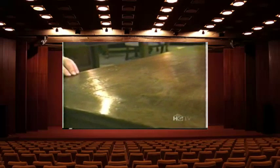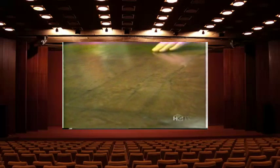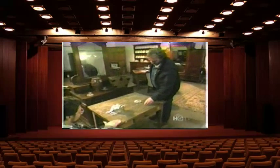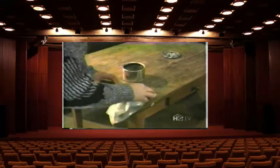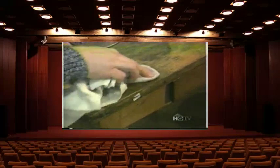The secret to the finish is not to disturb the natural wear. We never put the sander on them. We just clean off all the dirt and then build up layers of polish. So the day before yesterday, this table looked like this table — very much like this one. You see the dirt here? But basically the finish of the surface won't change very much, just the color and the depth of the shine. Just get rid of the grime and wax. Is this some of your wax? This is some of the wax. Can I give it a try? Yeah, please. I want to learn how to do this. So you rub it in — I can see right away that the wood starts to pick up its natural color again.